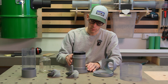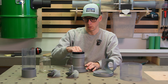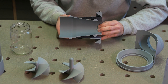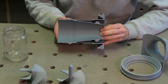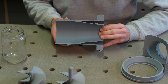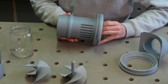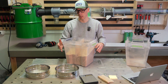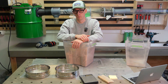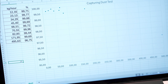The separator core is the main heart of the separator and I think it can still improve a little more. A cross-section provides a clearer view of the initial design. Printing required support due to an edge, which can be avoided by adding a bevel. I also shortened the dust outlet ports and straightened this edge. After all the changes I did run many tests with a mixture of wood shavings and sawdust, and it performed very well — with efficiency above 99.6 to 99.8 percent.